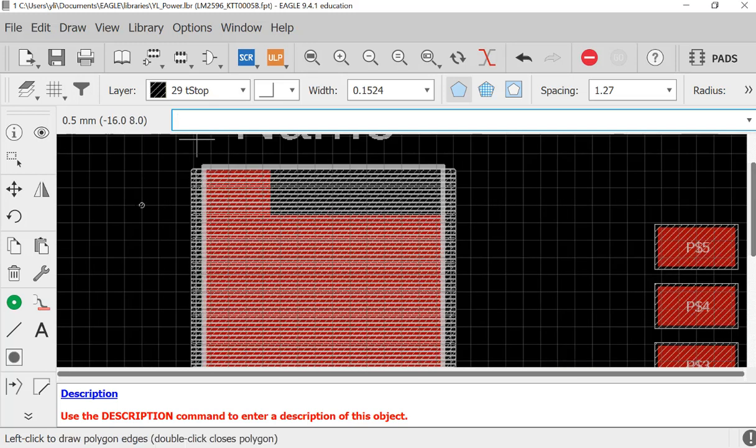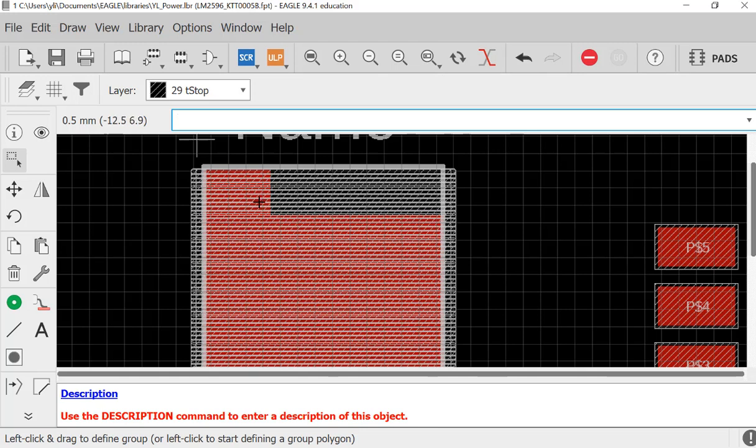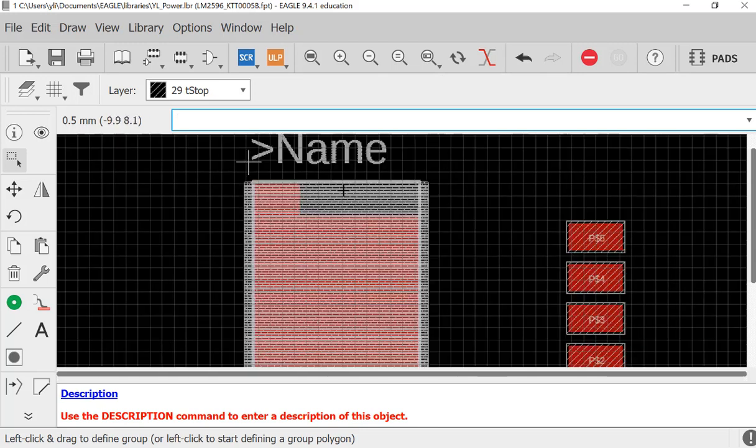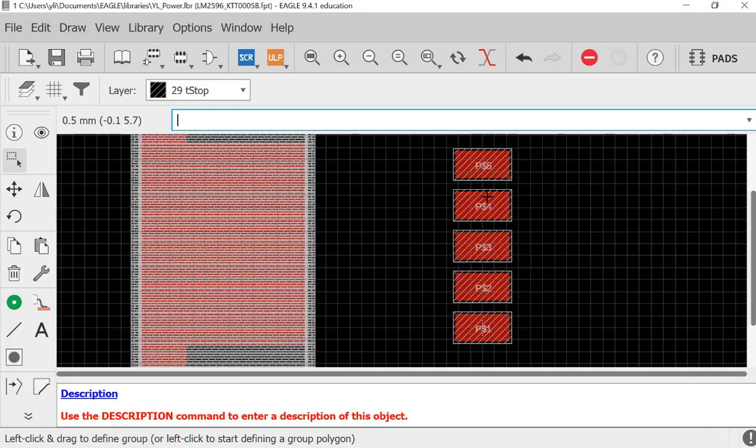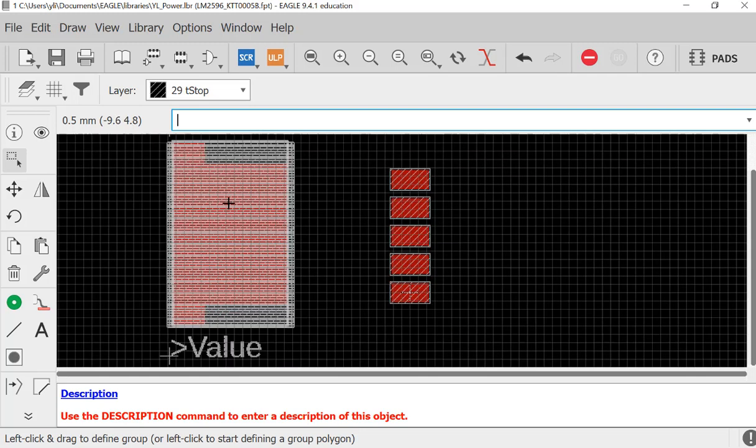Also, at the same time, the metal doesn't have to be this shape. You can directly make a rectangular shape. I drew it this way because it's shown on the datasheet, but I find it's not actually making too much sense to me. Here's another thing: all this copper being poured to your PCB on the top and bottom is going to be the ground line. If you have a metal plate like this that is not grounded, it's like an isolated island on the PCB, and it's not going to conduct any heat. So that's why it's not working really well.